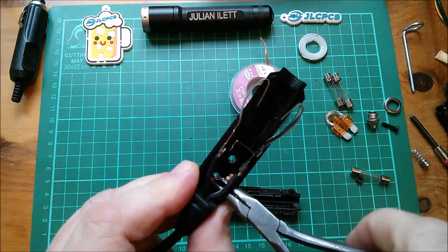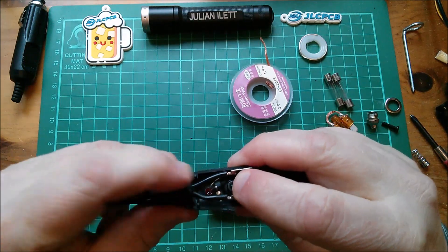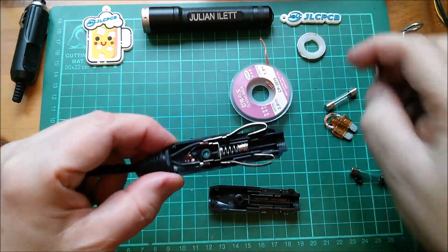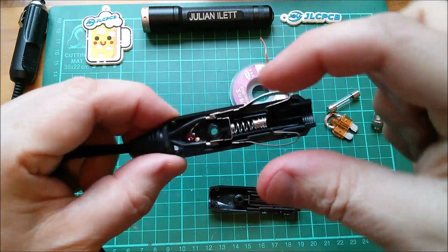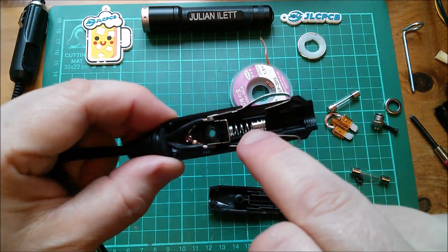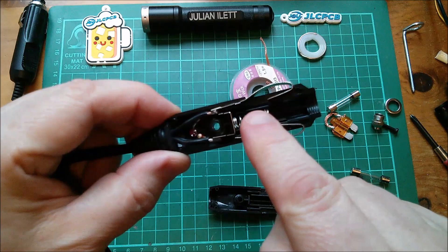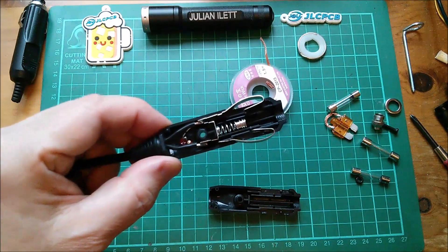Just try to get the LED to sit in its little hole like so - that's all the pieces in place. The spring is going to sit in there. Now I want to keep the fuse because obviously I want a fused plug, and because the spring has a sort of floating end, the fuse should sit on that little pip - that little nipple - with a good contact between the fuse and it. Then I just need a piece of braid to run around there and attach to that point. It's going to be quite a short piece - I'll cut a piece of braid.